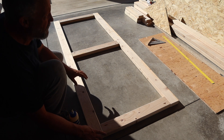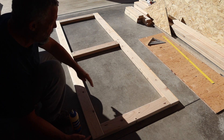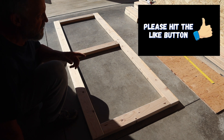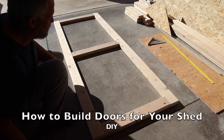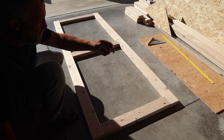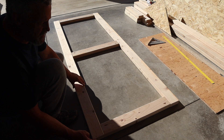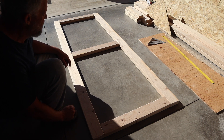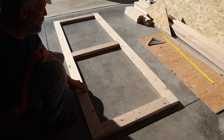The next thing is I've got my smart siding panel cut and it's one half inch wider than the width of this frame. I'm going to be gluing and screwing it down with about inch and a half screws and some Titebond premium wood glue all the way around. I'll put a screw on one corner after I get that half inch overlap measurement, tweak the frame if necessary to make it square, and then screw the whole thing with screws about every six to eight inches.